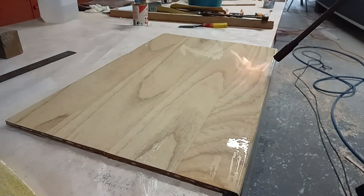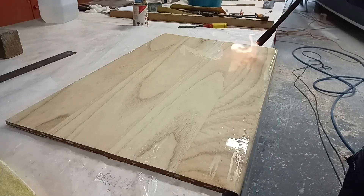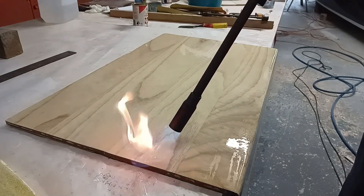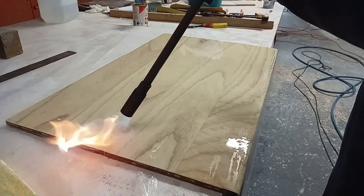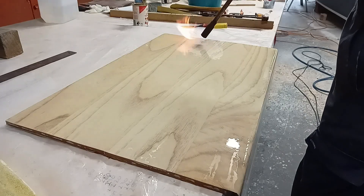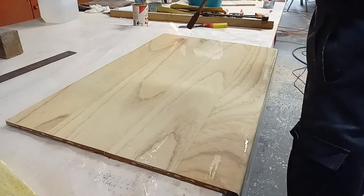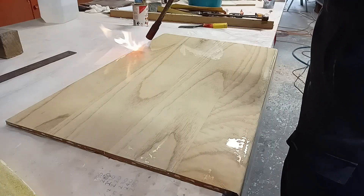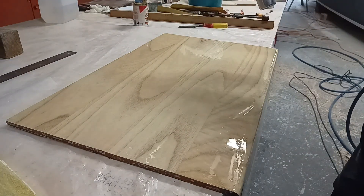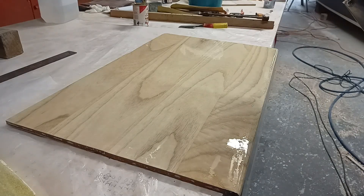I don't know if you've seen this method before — I hadn't until lunchtime today when I was looking up some videos on making carbon fiber bench tops. The flame is supposed to heat up the resin so it flows a little better and releases the bubbles. In my case the difference was marginal. This is a method I have used a lot before, going back quite a long way when I was building my 60-footer — using some epoxy thinner to break the surface tension and try to release some bubbles and flatten the surface a bit.